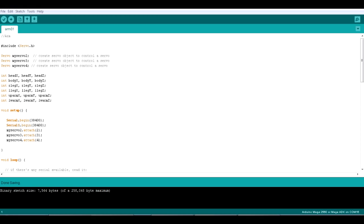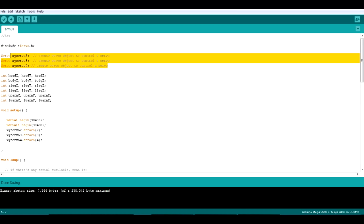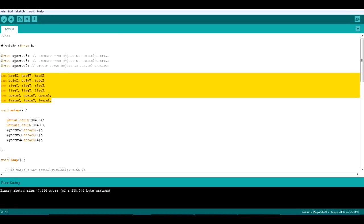The code I've got here is for the receiver that controls the arm. The transmitter side is just basically taking the data straight out of the inertial measurement unit and sending them over serial, so it's doing a serial print followed by the new line character which says that's all the data. And I've trimmed that down for now just to send the data from the 3 axis from the upper arm sensor. So in my receiving code I am using the servo library. I've declared the 3 servos there. I've declared all of the values and I'm using integers. I've lost the decimal points for now.